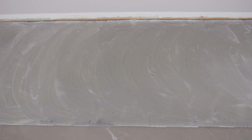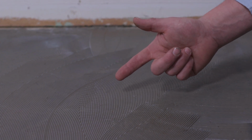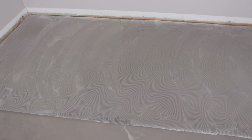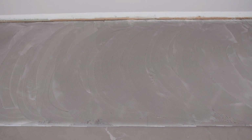The drying time will depend upon conditions such as temperature, relative humidity, and porosity of substrate. Allow adhesive to dry to the touch. Protect the adhesive from dirt and debris. Begin installing the planks immediately and cover within 1 hour after the adhesive dries. Only apply an amount of adhesive that can be covered within 1 hour from the time the adhesive dries to the touch.